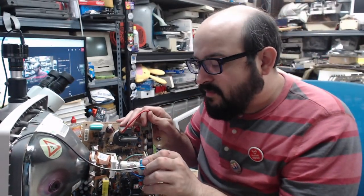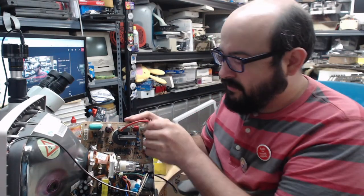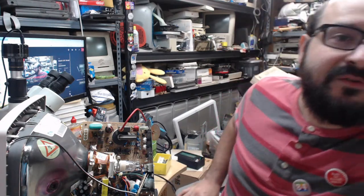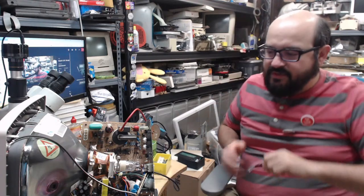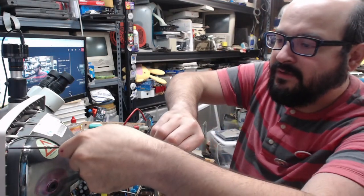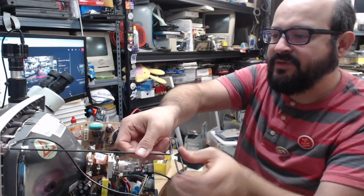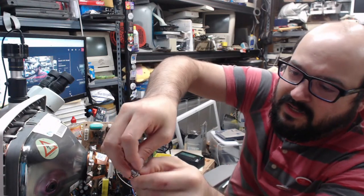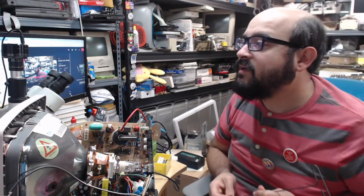Oh, that's right, this has to come out of there very carefully, because it's soldered onto the board, because Apple was too cheap on this model to give you a connector. It was a Mac Classic after all. Corners had to be cut. Where's the other tool? There it is. So I do have to undo the ground cable here from the chassis. Otherwise, I cannot move the analog board too much. Because unlike the Macintosh 128, 512, and Plus, where they have the yoke on a socket so you could actually remove it from the analog board, this is soldered in. Mac Classic has a curved face.